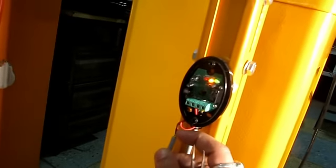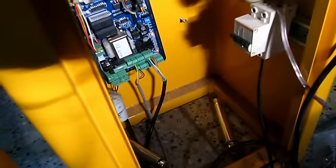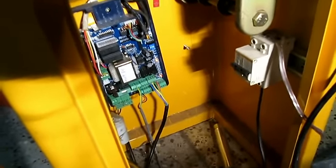These are the four wires for the photo sensor. Red and black are the power supply. The other two wires are green and yellow — this green and yellow is the NO (normally open) contact. Green and yellow go at the top as the NO contact; black and red go at the bottom. In some models you can have NC contact, but in this 801 model you have NO contact only.